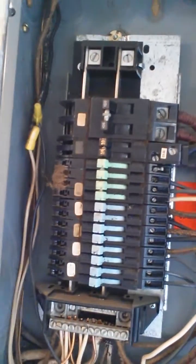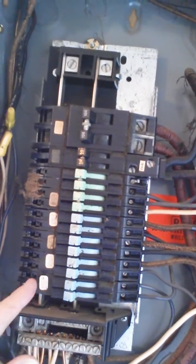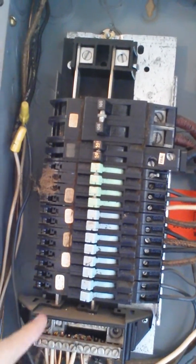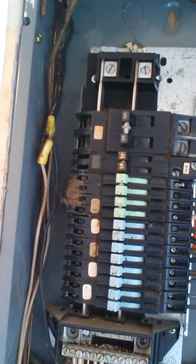What you'll notice here is that the design looks probably much more different than what you're typically used to seeing in your panel if you have a newer home. The breaker designs here are much, much larger than what they usually are — they're longer and they have a stab design where they stab into the two bus bars here on the main.